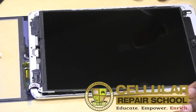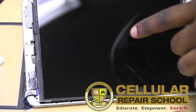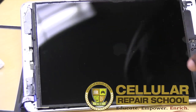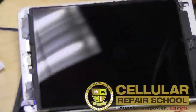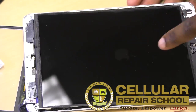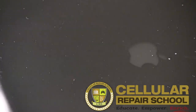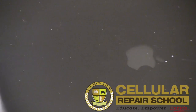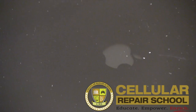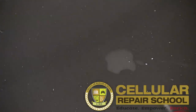Typically, I'd say 90% of the time, it's going to be because of your backlight fuse. There's a little blue fuse that we're going to be looking at. And many times, if your order of operation in regards to disassembly and reassembly is not correct, what will happen is you will get a voltage drop with a current surge as soon as you plug it back in. And that current surge blows your backlight fuse.